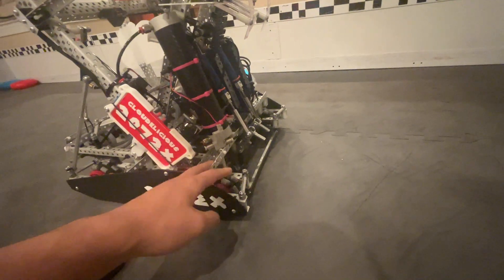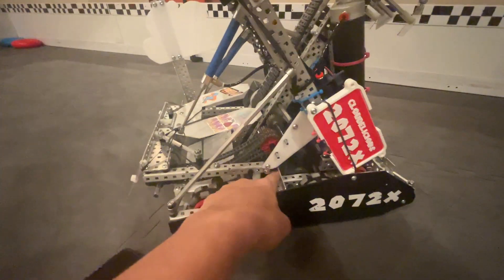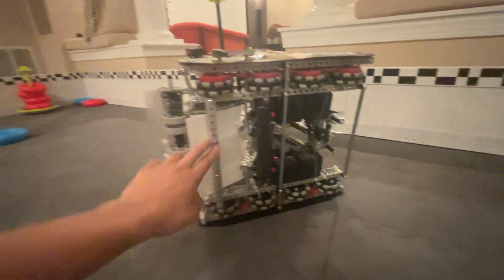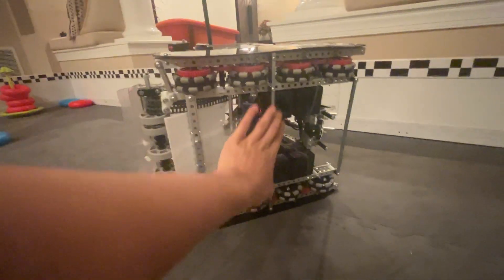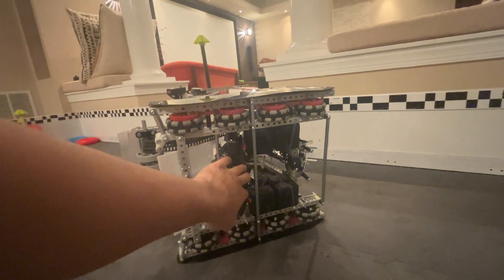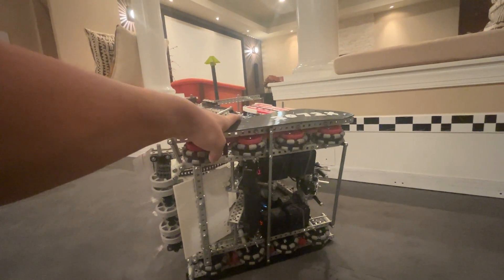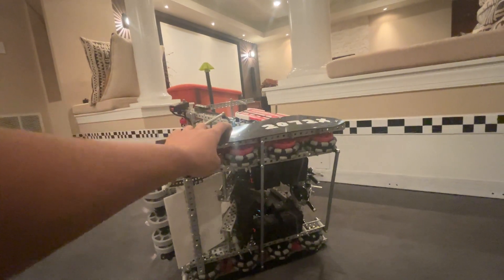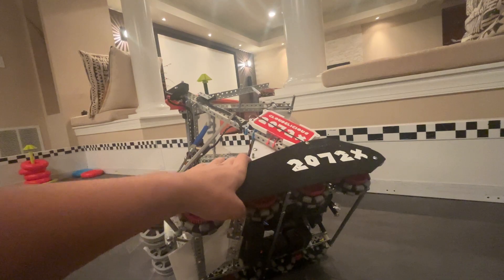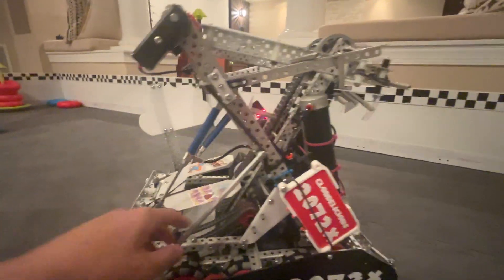Before Sugar Rush, we added this long cross brace. We have the short high-strength axle here, two short five-wides on each side, and also a boxed L-channel to hold up the intake poly and a full-length high-strength axle. We also store our battery down here — it's low profile, doesn't hit the hooks, and keeps the center of gravity quite low.